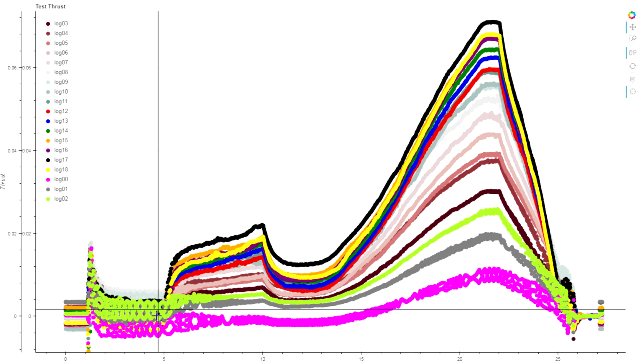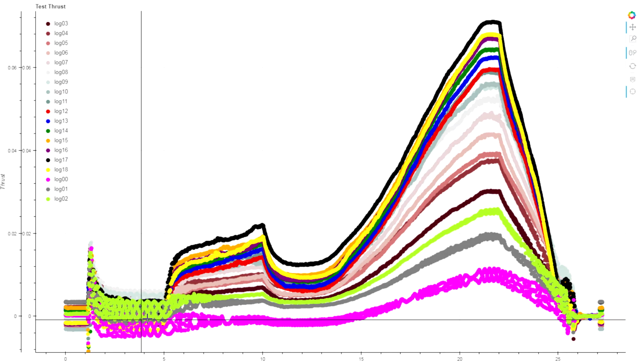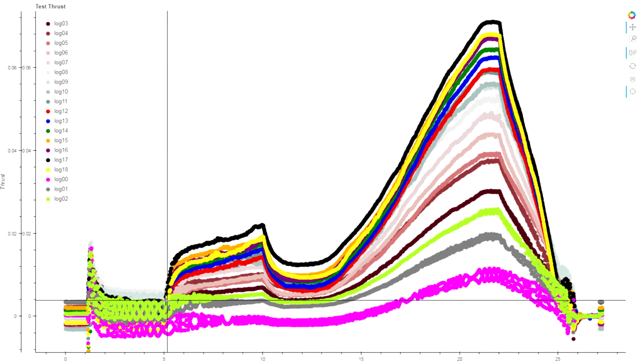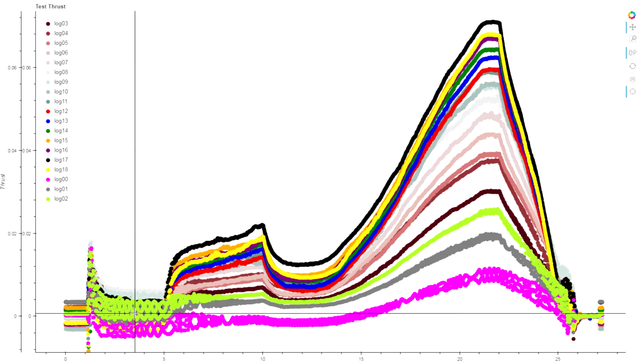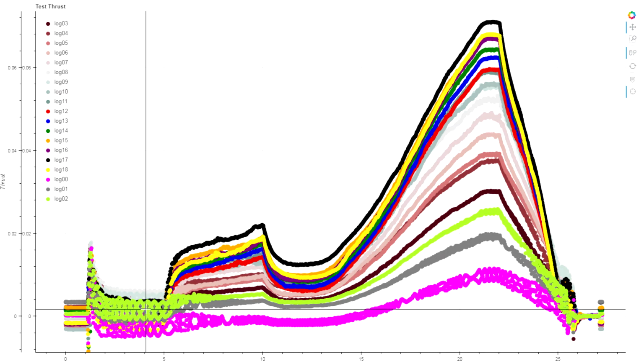So all of these values should be the same. And these values are pretty ugly. What we're seeing here, we're not actually seeing multiple traces, but phasing artifacts as our sampling rate falls in and out of phase with a much higher frequency amount of noise. It was something I was able to isolate in later tests. But for these purposes, we can just take a long average of these values and we can still bring them on top of each other.